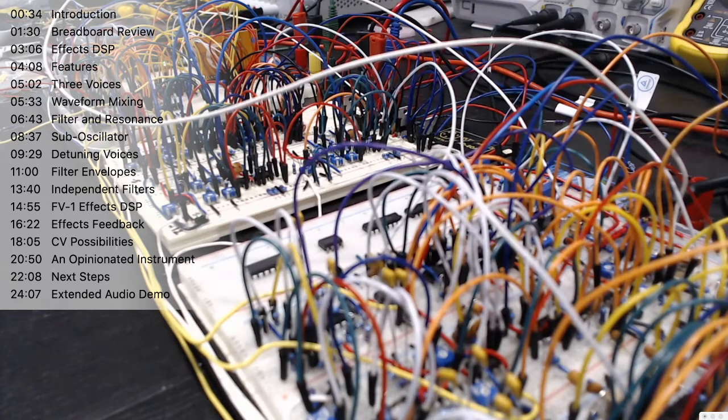Now, the ADSR, as I said, is a simple amp envelope ADSR, so not much to tell there. But the neat thing here is that the other three envelope generators are each wired to, there's two wired to the filter cutoff on the note voices, and a separate one for the filter cutoff on the sub bass. But then there's also a resonance amp envelope generator that's connected to the resonance on the note voices. So that allows us to do things like this.